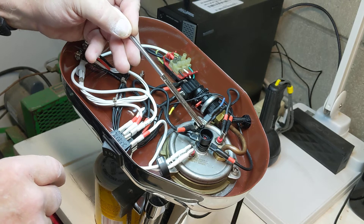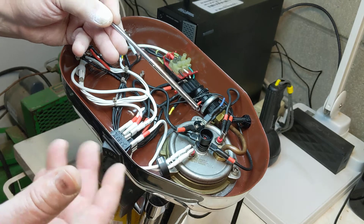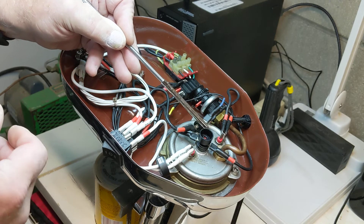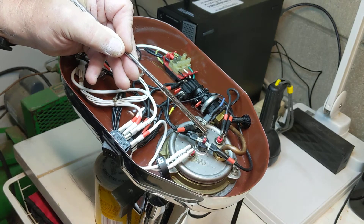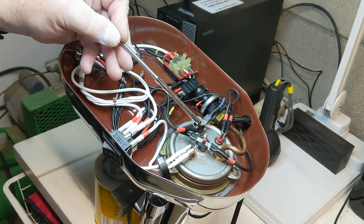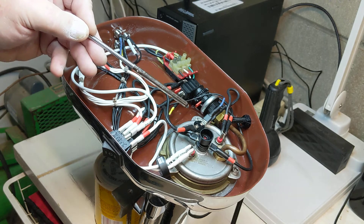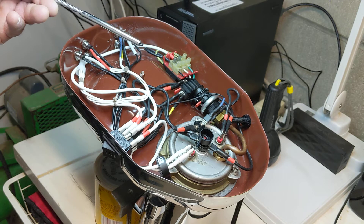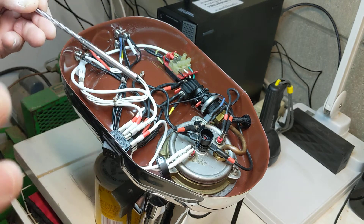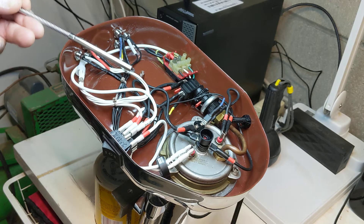The neutral comes off the element the same way, through the common and back to the connecting block. So I've really just added one extra circuit for the super steam using this 120 degree Celsius thermal switch. From Bong's experiments I could use a different rating, but I'm using this one first. I attached it to the stud where the normal thermal fuse goes and ran a second one off of there — there's a separate video on that installation.